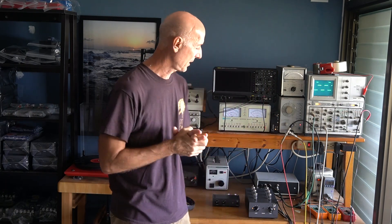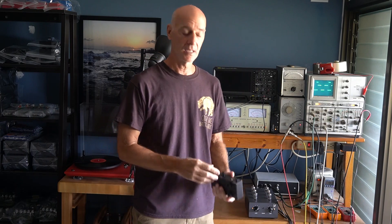There's always going to be a noise floor from the phono stage equipment, and that's hiss. You should always have a very nice benign hiss that's easy to listen to and you can hear below it. There should be no buzz or hum or other offending non-musical things. The hiss is always going to be there. In fact, I recorded hiss using this, and what you're going to hear is just the sound of the 47k loading resistor. And that sounds like this.